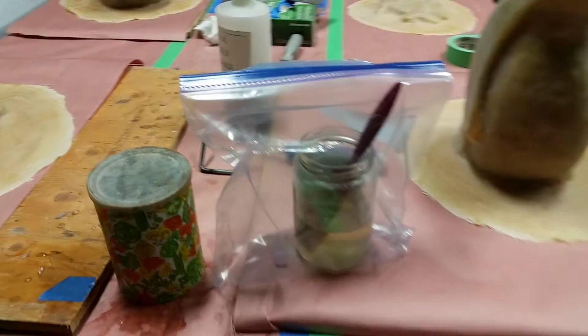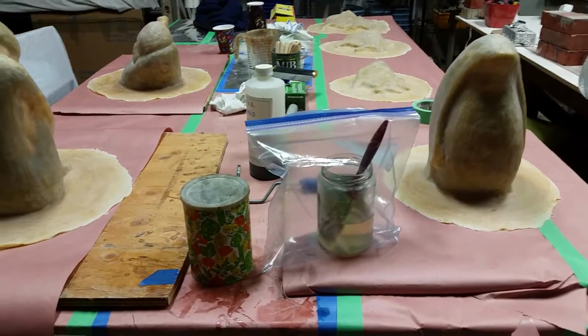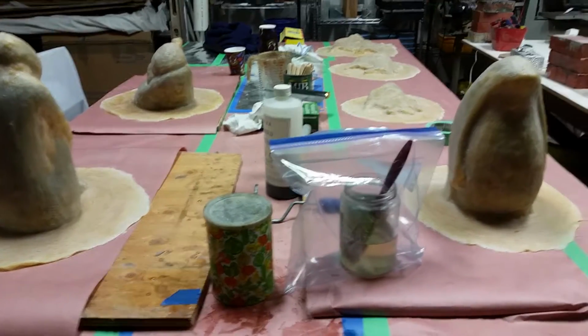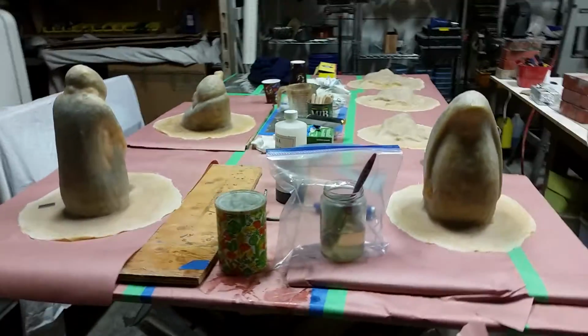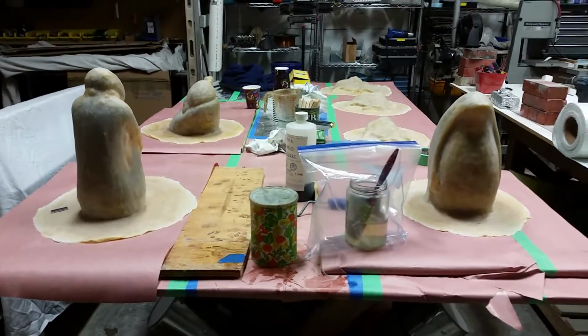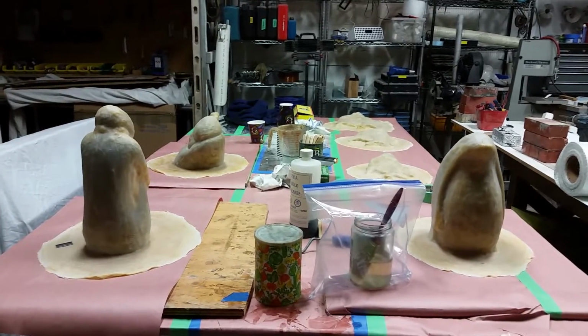The other tip is that at night in the winter here, I shut down my heat to about 9 or 10 Celsius. So when you come in and turn on the furnace, it takes a while for it to warm up. The problem is if you have your resin in this room, it's ice cold, and so is your catalyst, everything's ice cold. And you go to make a mix and it takes forever for that stuff to kick off.